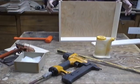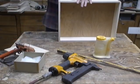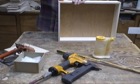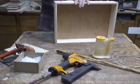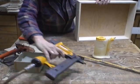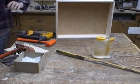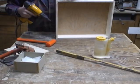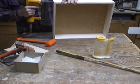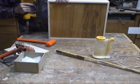Slide it in. If it pushes your sides out, the bottom's too big. And what I do, because you don't see it anyway, it's either in the back of the drawer or behind the drawer head. I put two one-inch staples in to lock the joint. It'll never come apart. It's quarter by one-inch staples.